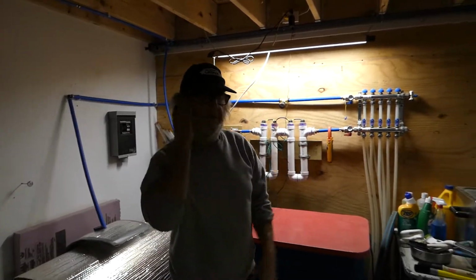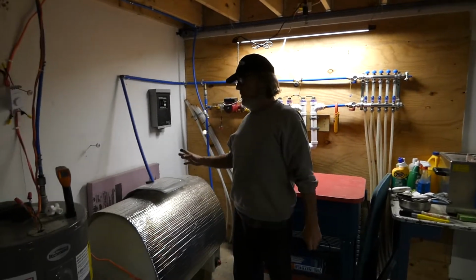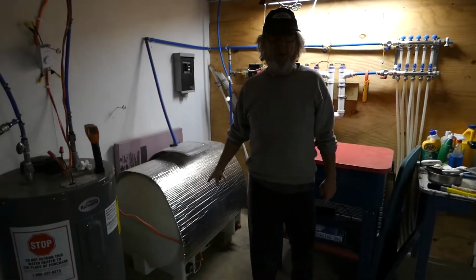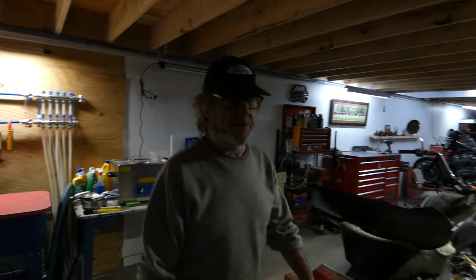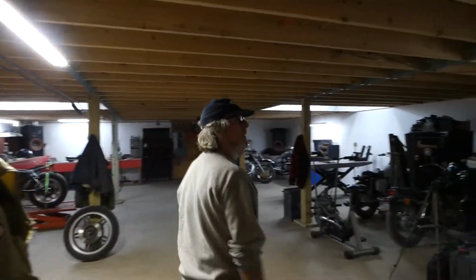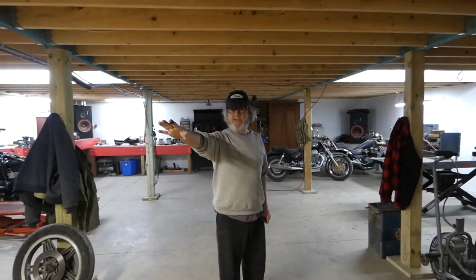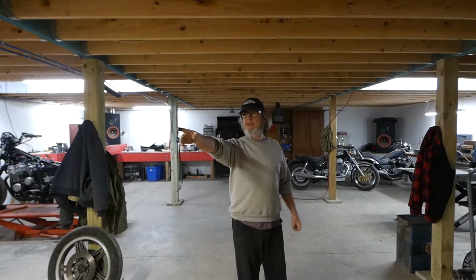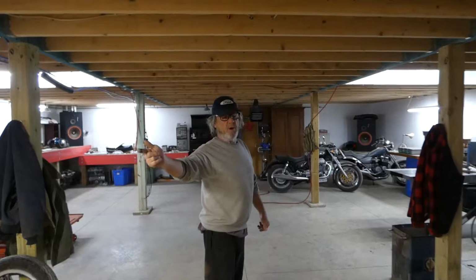I didn't notice much difference, but the point is DC direct is, we're wanting to just put the energy from the solar panels straight into the wire, then into the floor, right? And that's what I did all winter. It worked great. It worked wonderfully. And I got to check on the AC elements, the AC water heater elements from Menards, and they seem to handle the DC. It's between 300 and 400 volts, 7 amps.